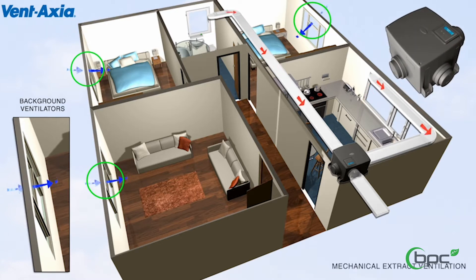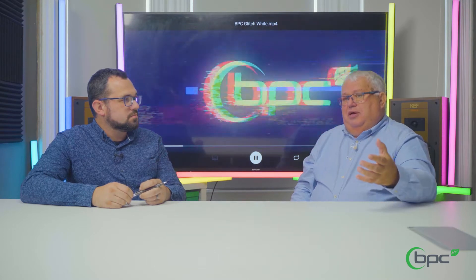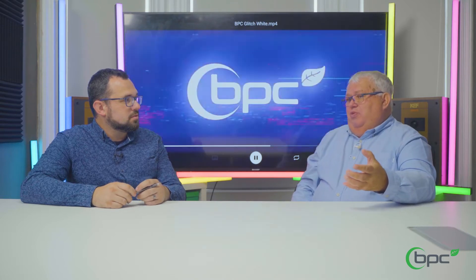You're really extracting air from the rooms that are the principal players in standard house problems — mould and condensation. You're basically extracting that warm moist air through to a central point, and that's what's called a centralised MEV. You're doing away with that problem of mould and condensation which we see in new build projects that are not correctly ventilated — we see that on quite a common basis.